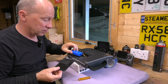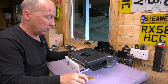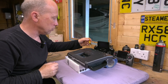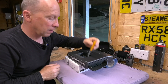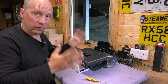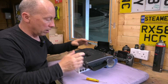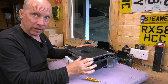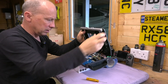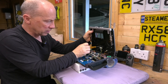Remove the battery — it just plugs into the back of the radio. Undo the cover and take the battery out, leaving the cover off. There are a number of screw holes all the way around the back of the radio — one, two, three, four, five, six, seven, eight, nine, ten. Remove all ten screws. The back of the radio will lift straight off. There are wires connecting to it, so lift it off carefully and tilt it upwards so you don't need to remove any of the wiring to the external port.